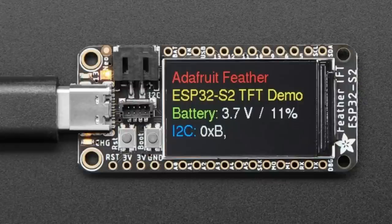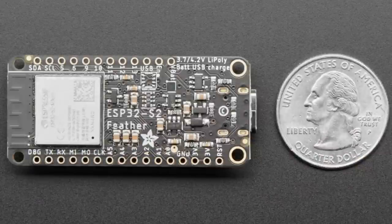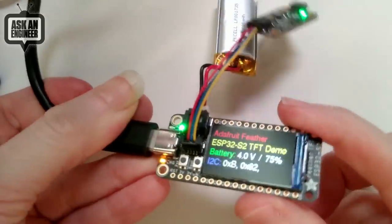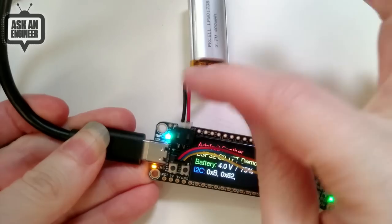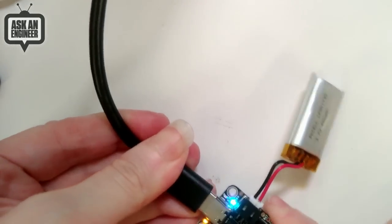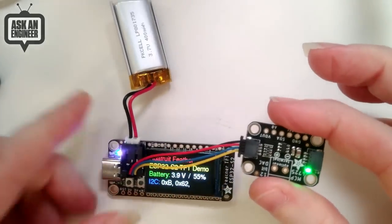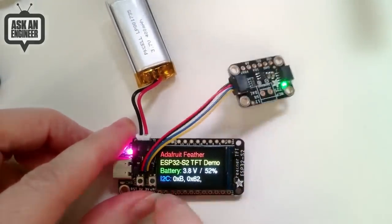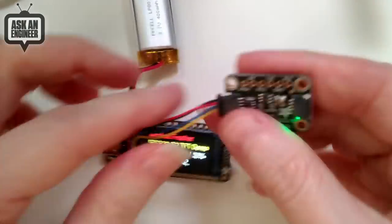You might remember the TFT Feather from last week — I rearranged stuff and hid the power supply, so my demo wasn't successful. I really wanted to show this off, so I'm bringing it back. This is the ESP32-S2 TFT — it's an ESP32-S2 chip with a 240×135 color IPS TFT. IPS means you can read it from angles and the color is beautiful. It's got a battery port so you can run it off a battery. It has a STEMMA QT port — so if you've got that MCP4725 you want to add a DAC, just plug it in and chain I²C devices. There's a reset button and a boot button on the bottom.